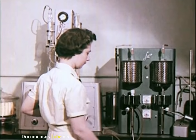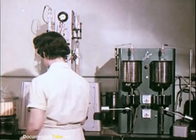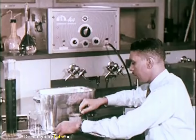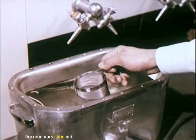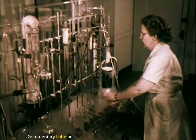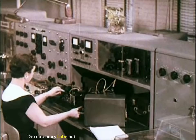In Harrison, all incoming basic materials are sample tested. The control of purity of the materials used in making tubes is a vital necessity if contamination and breakdown are to be eliminated — another example of the philosophy that to produce the best, you must begin with the best. Research engineers work with the unusual: machines that clean materials with ultrasonic sound waves, machines capable of testing the strength of wire finer than a human hair, and even liquid nitrogen as well as induction furnaces capable of heats of over 4,000 degrees Fahrenheit.